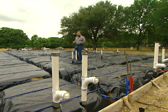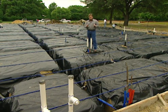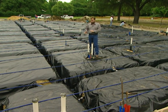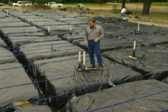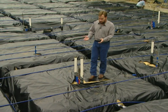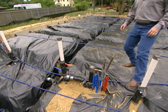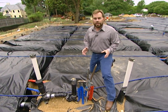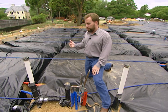Here in our kitchen we have a great example of planning ahead. This is going to be an island with a sink in it — we've got to put our pipes in right now. You don't want to jackhammer that concrete up later. You could end up getting into your post-tension cables or rebar, it's going to be hard to make it drain. You've got to plan ahead. This little area actually takes care of two bathrooms upstairs plus a shower and steam shower in our cabana room.